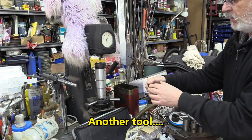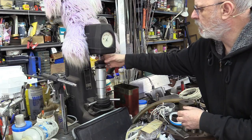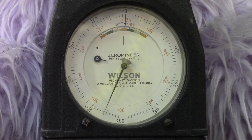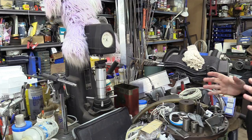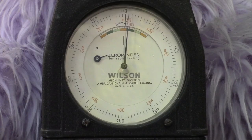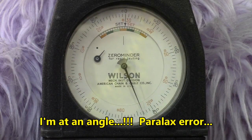Going to make sure they're clean. Make sure the surface there is clean also. Is it fitting in? Yeah, no problem. The other direction. Get to the calibrated point. A little bit more, that's it. We're good. Release. We've got to wait till the handle completely finishes travel to get the first indent right in there. It's done. Let's see what we're getting. It is like 43, a little bit over, like 43 and a half.